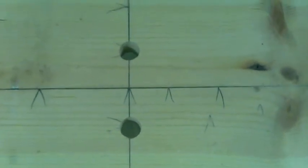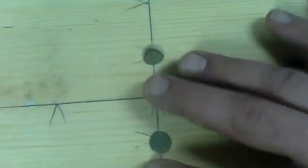Here's a little bonus material — talking about measure twice, cut once, in this case drill once. I got a bunch of marks here, changed my mind a couple times, measured more than twice, but I got it right. To go on about the holes: drilling halfway through from each side — if you drill, you get a nice clean edge on the side you start from. If you drill all the way through, you're going to end up cracking, chipping, and splintering your wood. Halfway one side, halfway the other — nice clean edge on both sides. It's going to get covered up by the light socket anyway, so it's kind of just aesthetics.